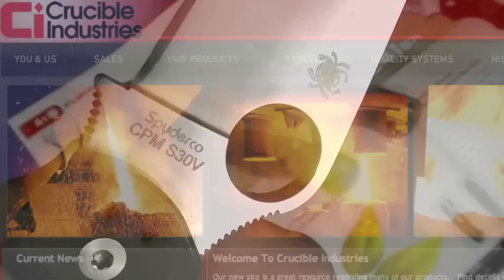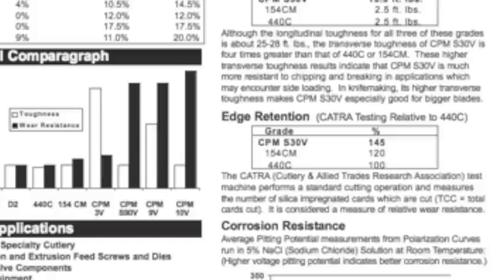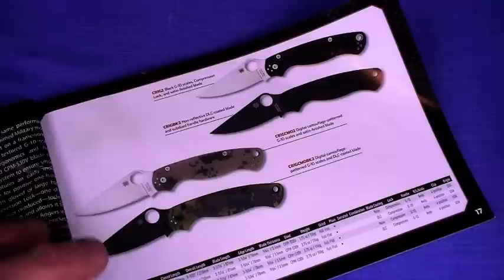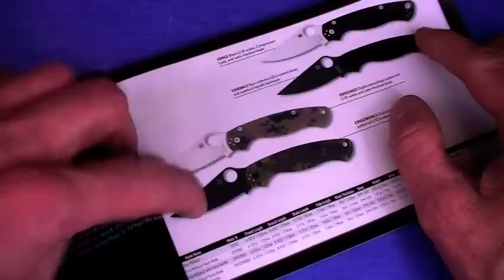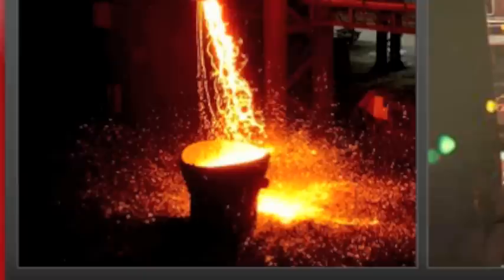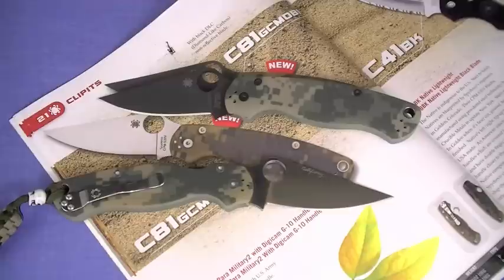Welcome to CPM S30V - or any CPM steel for that matter. You get uniform distribution of fine carbides, no alloy segregation, and very fine grain. They'll tell you it has better wear resistance, better toughness, better grindability and polishability. For the maker, grindability matters because grinding machines wear out and cost money to replace. It is a selling point. But specifically speaking from what I've seen, maybe not that big a difference overall. If for the same price I'll take CPM hands down - if it's a 5%, 10%, or 20% increase in fine grain structure, I'm game.